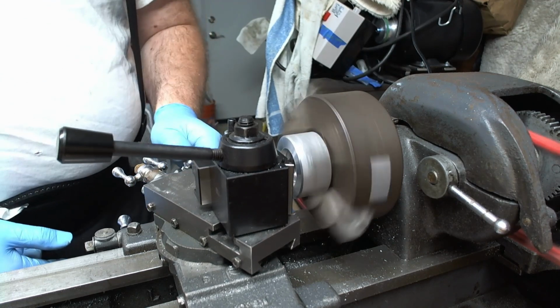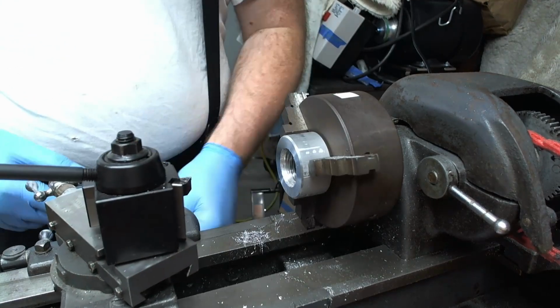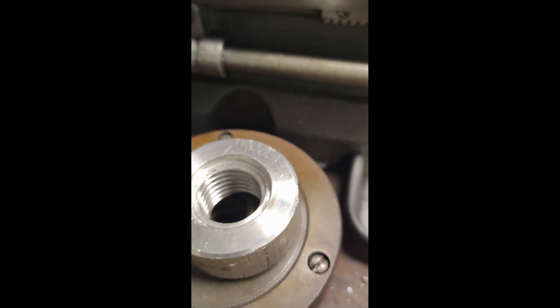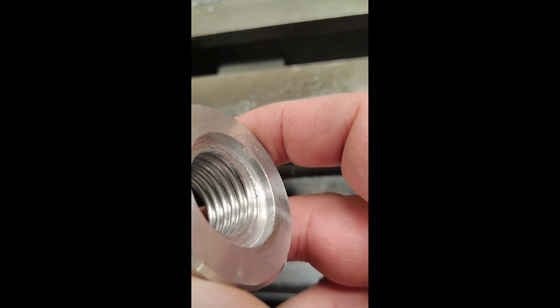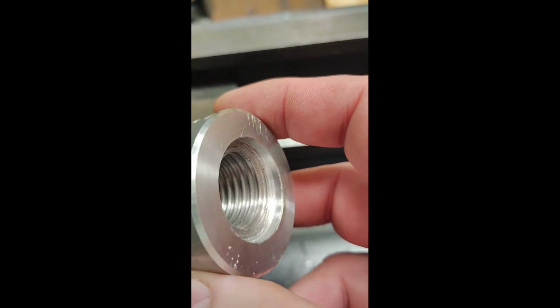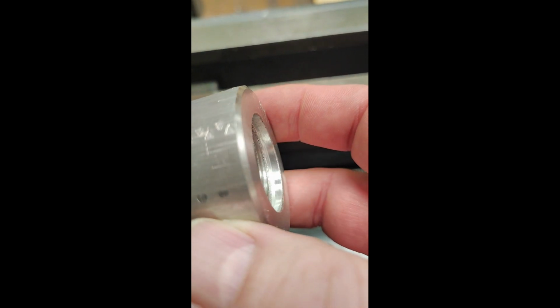But yeah, it works so much better. So if you're doing lathe work, make sure you get your cutters at the right height. That's the big key. It's amazing what having your bit set at the correct vertical height will do. Initially, when I was trying to clean this off for that anterior edge, the bit was set too high, and that's why it was making such a rough cut. So I lowered it slightly, and it cleaned that up to a much nicer shoulder.